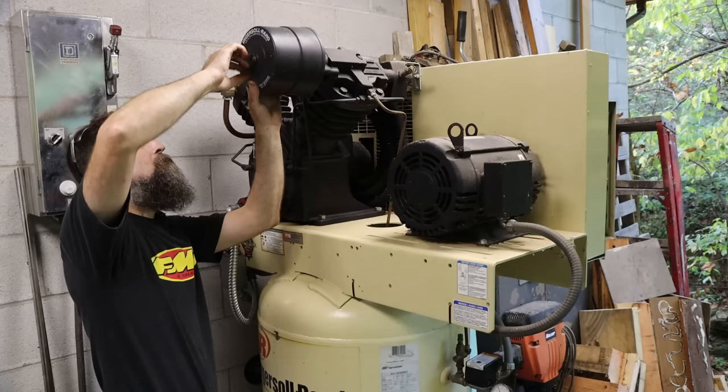So in the case of wheel bearings and electric motors and stuff, it's really easy to overdo it on the grease. More grease does not equal more better. As long as you got enough to where when the bearing heats up, the grease melts down and gets in the bearing, that's good enough. If it's completely full of grease, it can't get out of the way of the rolling bearings. Those bearings continuously churn that grease, create a ton of extra heat, and can cause seal failure, bearing failure. Sometimes it takes a lot less than what you would think would be optimum.